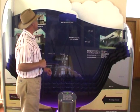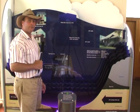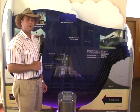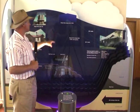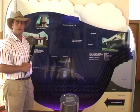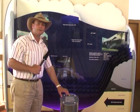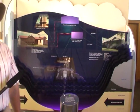We know we have water storage tanks at Potter's Point and Keegan Drive. Those tanks have electronic level indicators installed in them and will detect when the water level drops. When the water level drops to a predetermined level, it will send an electronic pulse back to the MCCs in this building, or the electrical equipment we saw in the other room a little earlier. So what we'll do from here is push the green button on this model and demonstrate to you how we get water from Mount Gambier's Blue Lake.